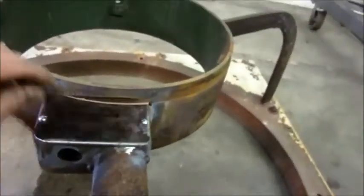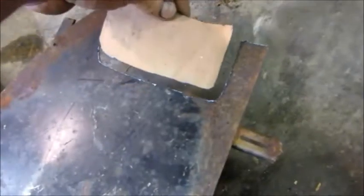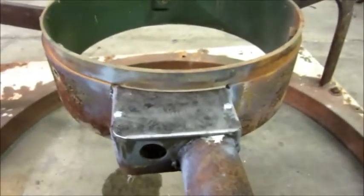I got this little cover plate made. Made a cardboard pattern, took it and clamped it onto this whole piece of a pressure washer belt guard, used some little clips to hold it, then simply cut it out with the plasma torch around that. When I put it up here, I marked it from the inside and folded the lip over to give it a finished look. That'll take care of that — one more step out of the way.